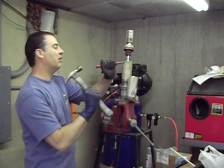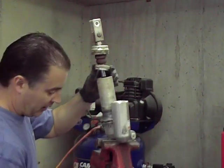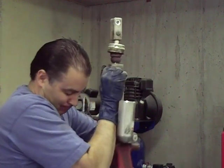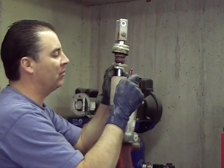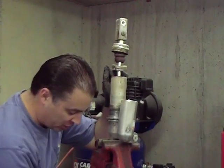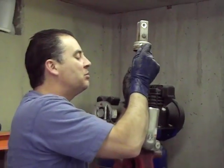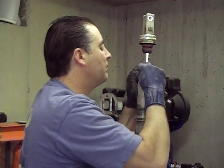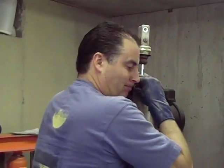There's a little cap right here that's just a dust cover — that comes off. Inside here is what's called a seal head. It looks pretty clean, looks okay. What we're going to do is push this seal head down — there might be a little bit of pressure still in there. Because there's a clip ring in there you have to remove. Oh, there was some pressure in there — that's the reason why.